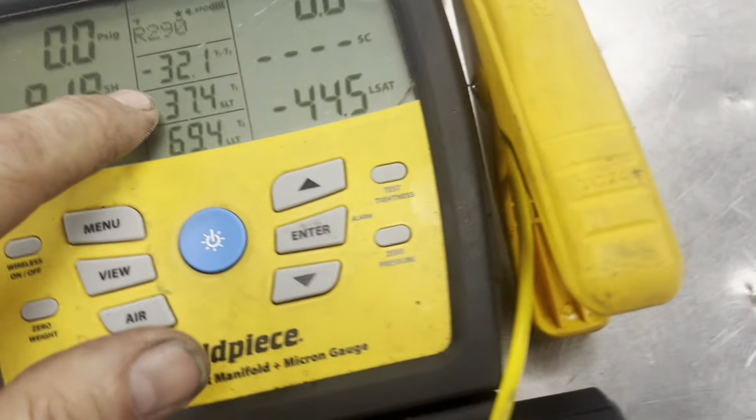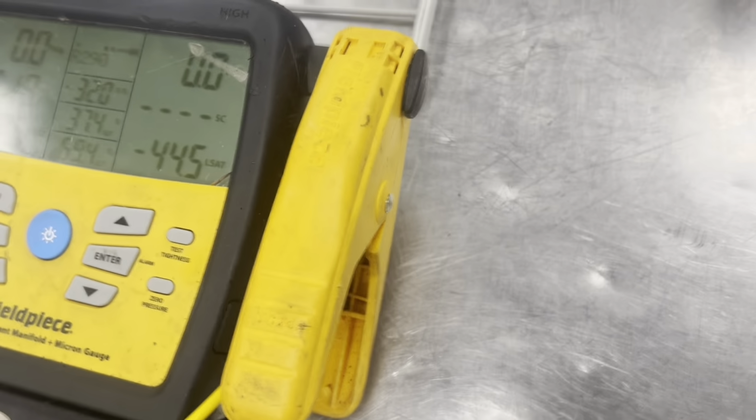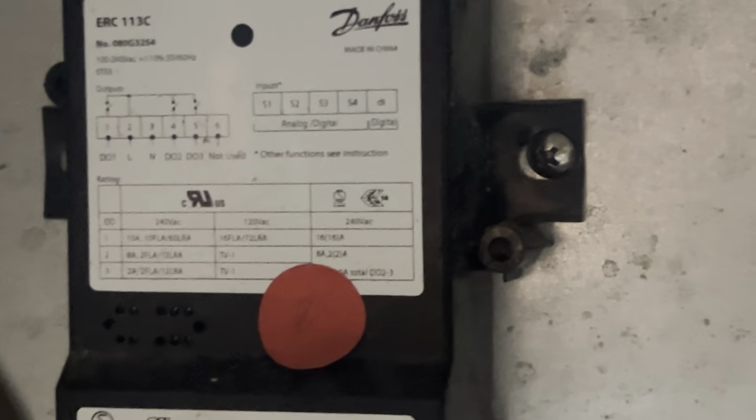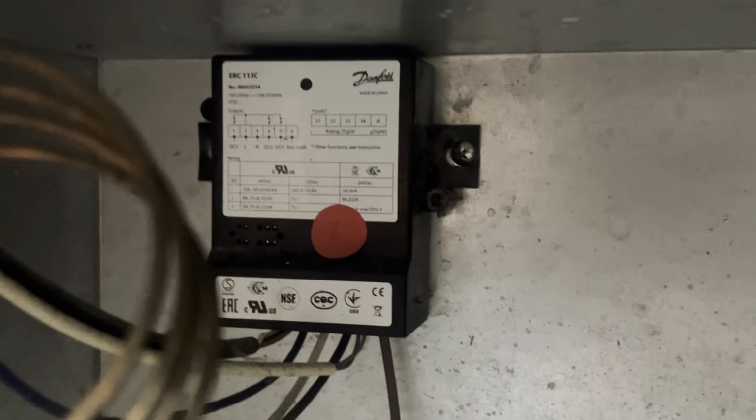So I'm going to give it a little bit of hot air. Oops. Now again, this is air temperature, and that temperature probe is going to run on coil temperature, no doubt, because it's a cooler. There's not going to be a defrost. Although, I haven't really looked at it. This may have a defrost built in. Let's look together here. No, it's just dropping out.